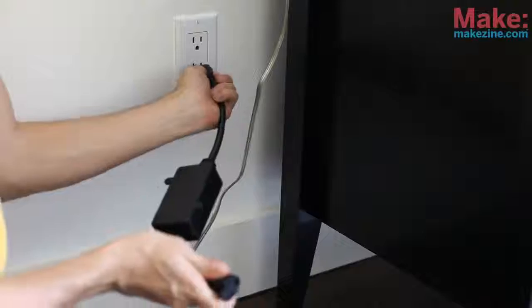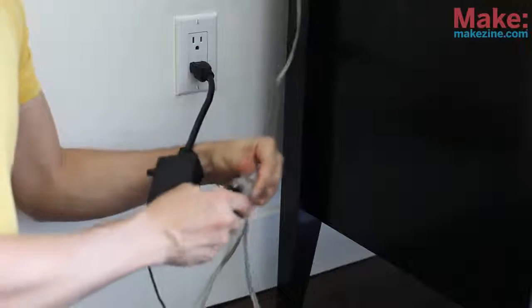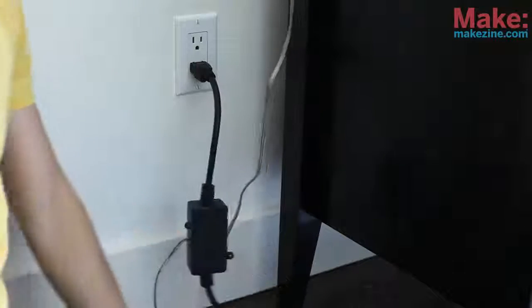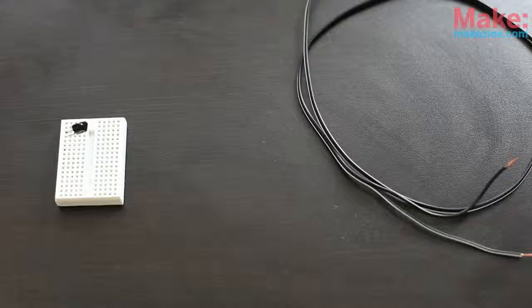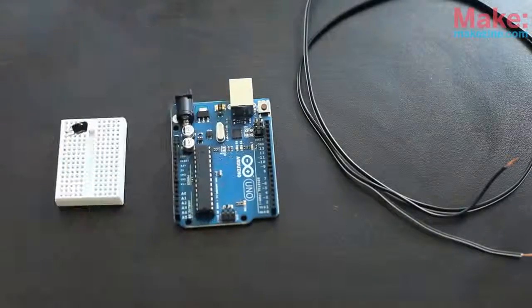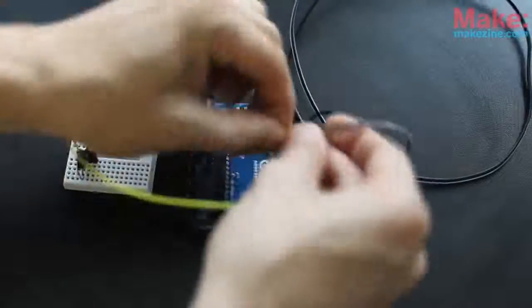And how do we turn off the lights? We use the power switch tail I mentioned before. It plugs into your wall and you plug your lamp into it. This wire is what we'll use to control the power switch inside. So how do these work together? Well, that's where the Arduino comes in. We'll hook both of them up to the Arduino pins and write some code to upload to the board using free software.